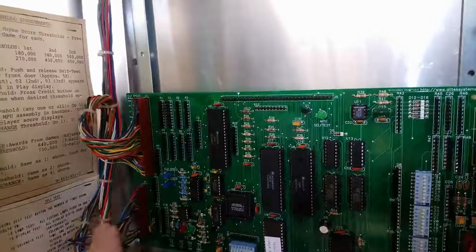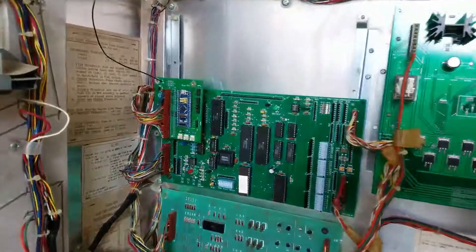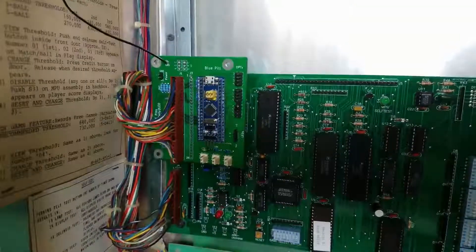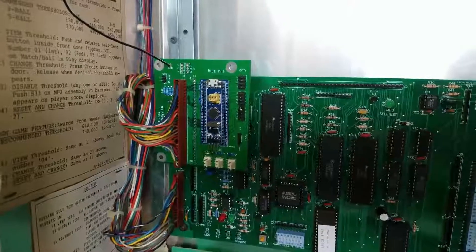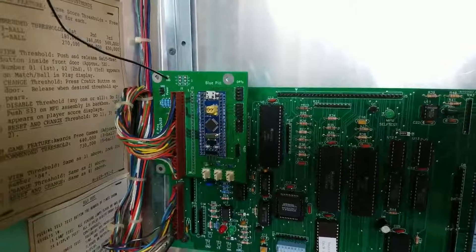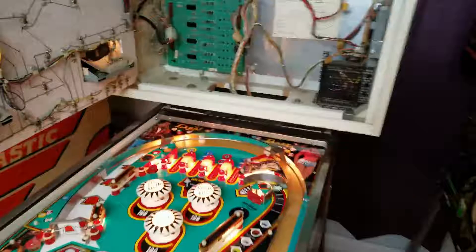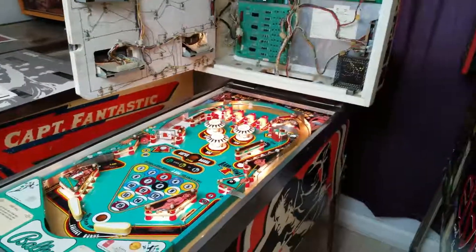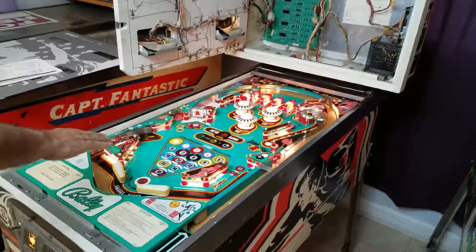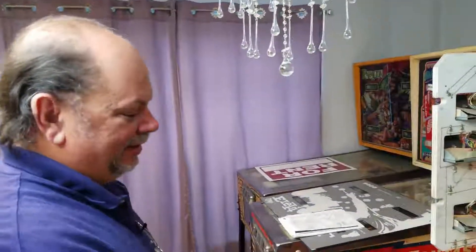What we're going to do is unplug this cable and install our little board. Okay, we have installed our board piggyback on top of the other board. Right now we don't have any power hooked up to it, but it should be able to work just fine like this. Before we hook up power and hook up our LEDs, we're going to make sure that this board isn't doing anything to affect the play of the regular game. You can see all the lights are working — the signal is passing from the MPU through the LED board and into the rest of the circuits that are powering the lights on the machine.